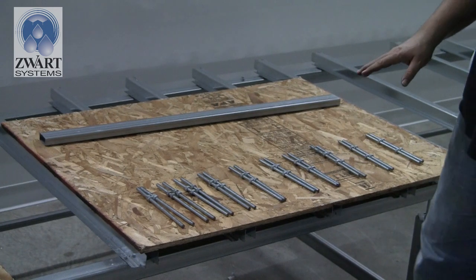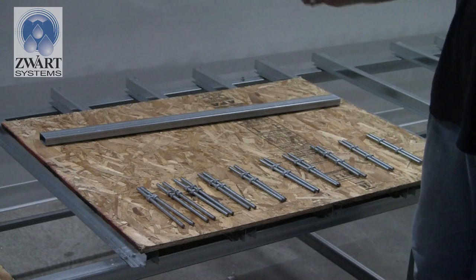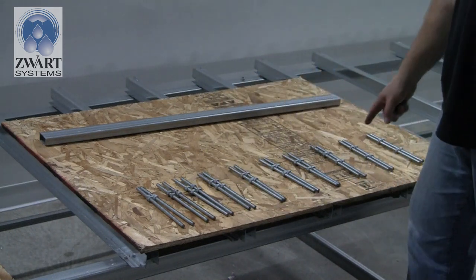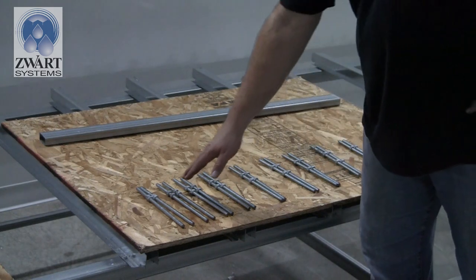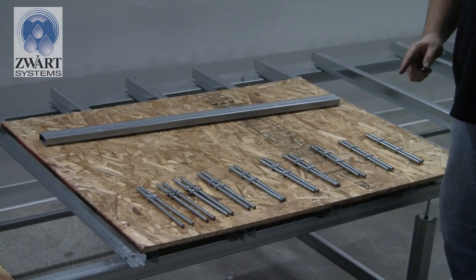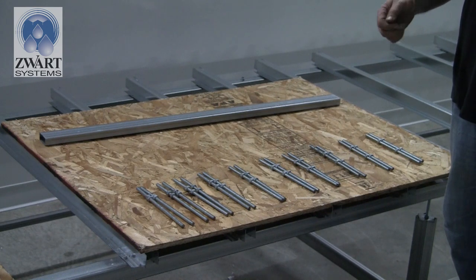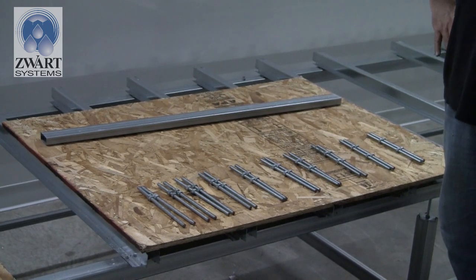All the nuts are set — the tops all have the same spacing for the two-inch square tubing and the quarter-inch nut on top, but the bottom nuts are stepped down a quarter inch on each one. We have ten sets for our ten legs — the lowest adjustment goes on the back, highest on the front. Don't worry too much; you can still do a final adjustment after it's built using an open-end wrench.